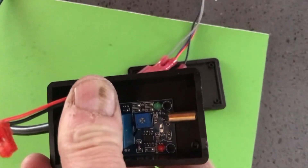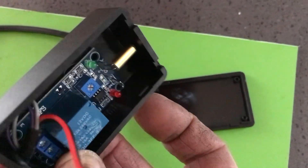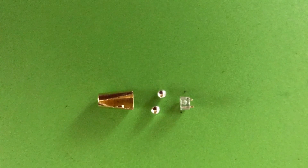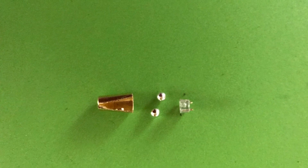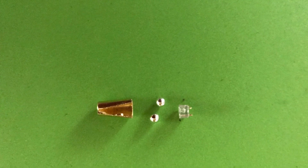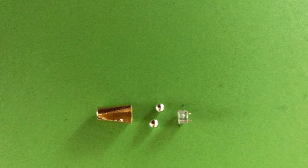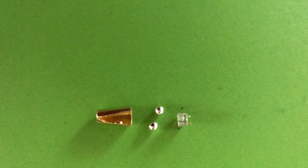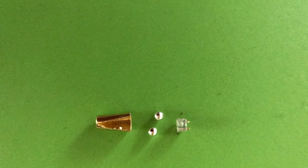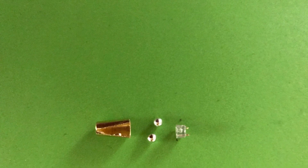The clacking comes from that cylinder. So what I did — I removed that cylinder and very gently hacksawed it and opened it up. And there it is: you can see it's two balls, two ball bearings. And you've got your contact — the clear plastic thing at the other end — that would have had two wires to the prongs sticking out for the block connector to click onto. That's all it is: two balls inside there. That is what was wrong with this original ST2 brake module.